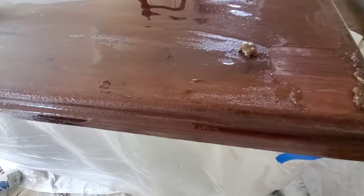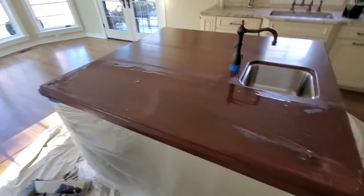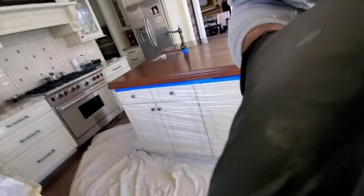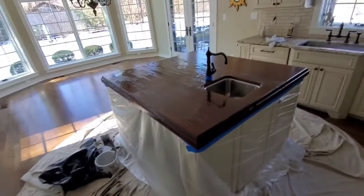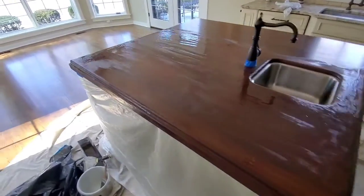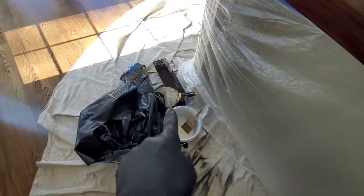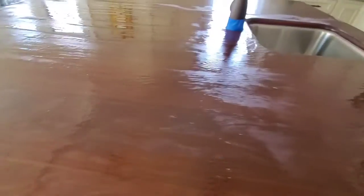Sometimes you've got to give it more than 20 minutes, sometimes less. I'm going to try the six-inch blade now. Here's the deal about scraping woodwork like this: the stripper will soften the wood. I just wasted about seven minutes on a video that ended up only two minutes long, so you guys missed what I've done. You can see how it's drying up — I've already scraped this first third once and got rid of the old stuff. It's in my pan. Then I applied another coat, not as liberally.